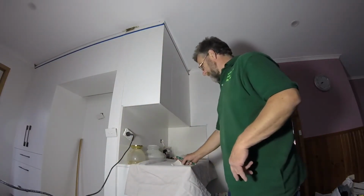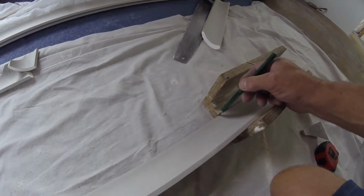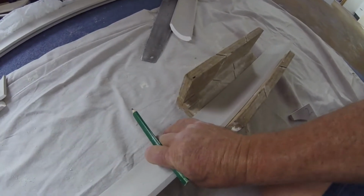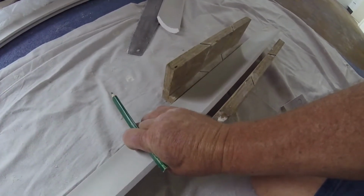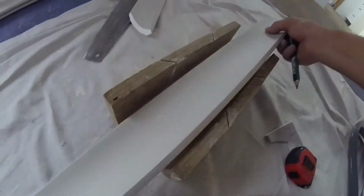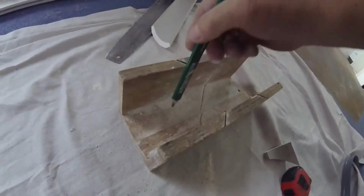Alright, we'll transfer that down to the miter box. You can see that this is 55mm cornice. You've got a slot here that sits in the box there, 55. That's 75 if you're cutting 75. And you turn the box around actually, but the full width is 90. So if you're cutting 90, you turn that around, and she'd sit from there up to here.